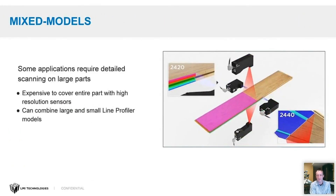In addition to the five layouts discussed, you can mix and match sensor models. For example, when scanning a board or drywall, you can use different sensors for the top versus the side — a wide field of view, low-resolution profiler for rough inspection of the top, combined with a high-resolution, narrow field-of-view sensor for a detailed view from the side. By combining them you use fewer systems but see all the features you need with the accuracy you're looking for.